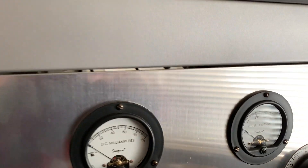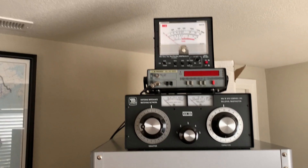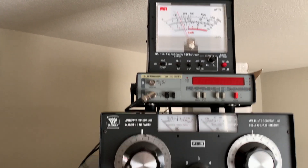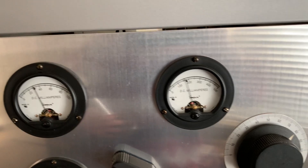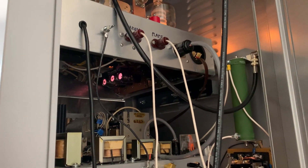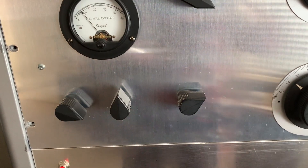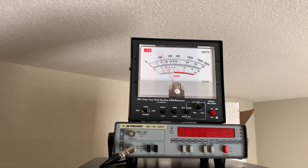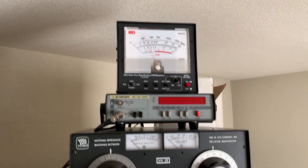The problem is my power's still down. I think it's this tube — that's what I'm getting ready to do, change tubes. That's like 175 watts; the power's really dropped. The plate current is way down. The regulator tubes are lit up, and when I modulate they dim down, but they're not dimming down as much because I'm having to load it heavy to get the power up. I'm actually on the 160-meter loading position, so I'm going to back that off and readjust it, which will drop the power about 20–25 watts from where it is now. Then I'm going to change tubes.